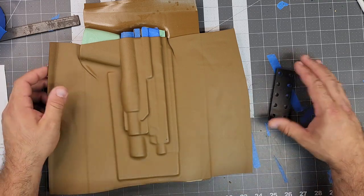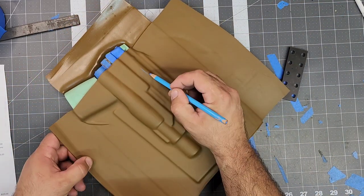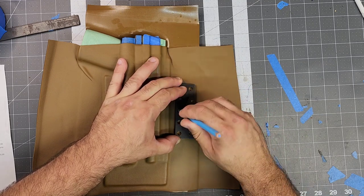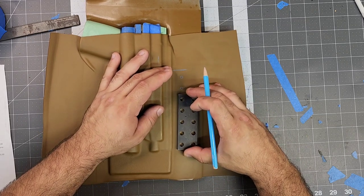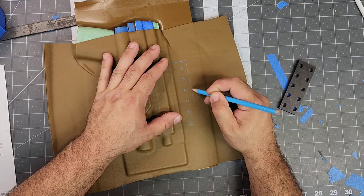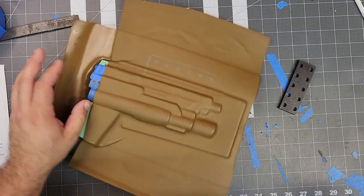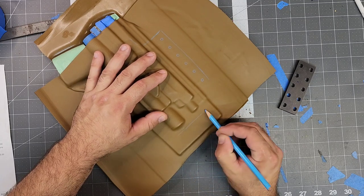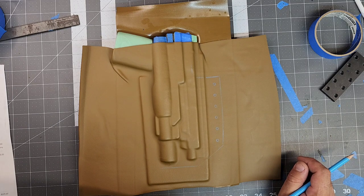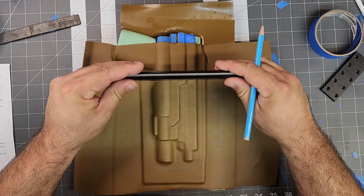It is underneath the PSA 5.7. So we know that this does an RMR cut and the RMR goes to about there — you can see it right there. So we're going to come down past the RMR and go right there. We'll come down probably that way. One more. So there's that right there. And then pretty much I'll just come straight across on this side and we'll judge this part after. This is going to be like so — it's going to come up. Let's get the straight line. Where's my contour gauge? Right where I put it. Let's get this line right here going.